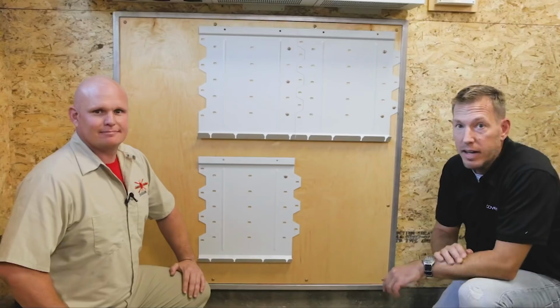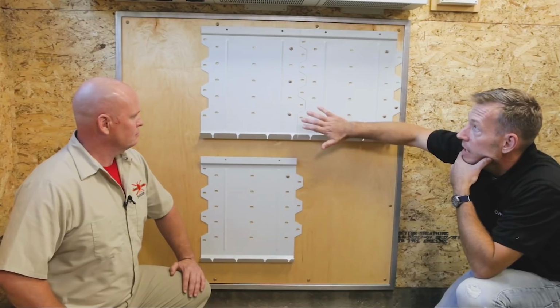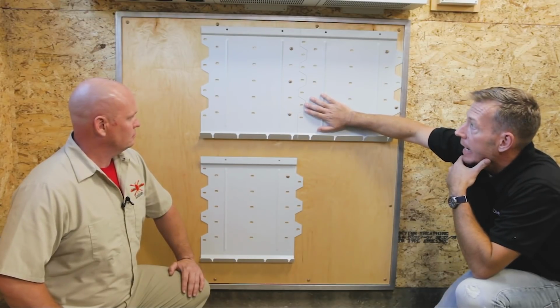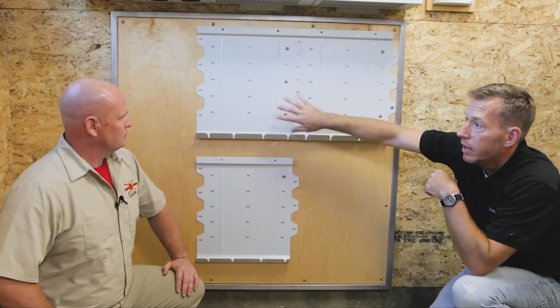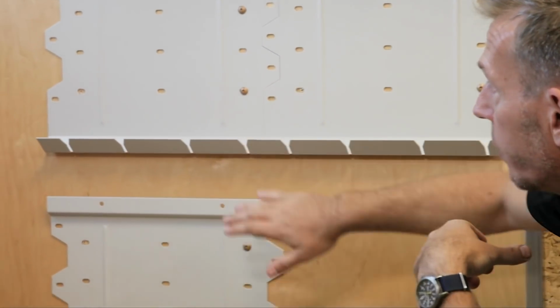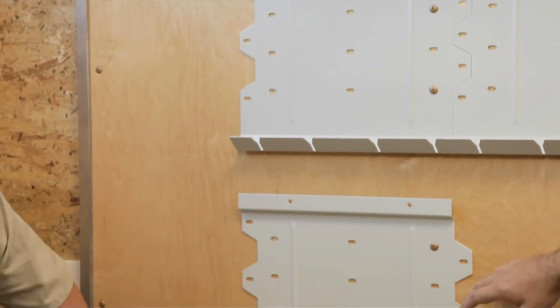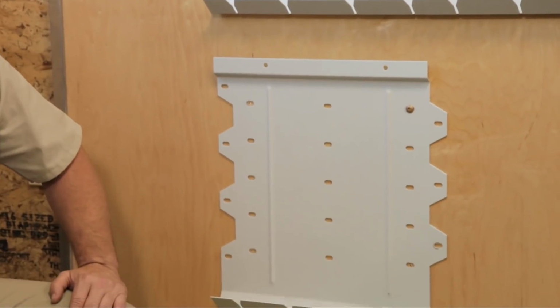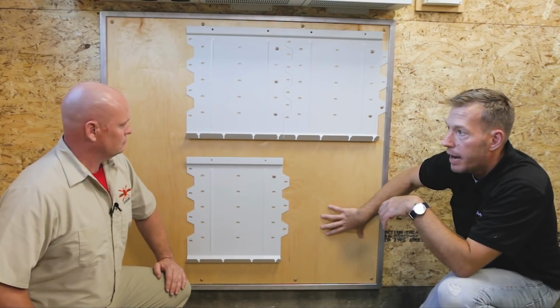Okay, awesome. So we're back from our lunch break, and we've basically mocked up where the mounting bracket's going to hang. Again, we've got them affixed solidly to the studs, at least 2 points on the outsides. They are heavy batteries, 90 kilos a piece. We've also left some spacing here for wire runs and conduit. Essentially we've got 3 batteries stacked at present. That's what we're going to install today, but I'm planning for a 4th battery in the future.